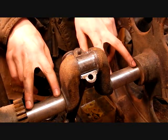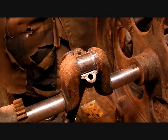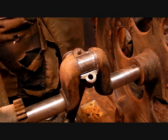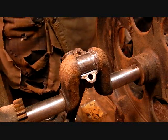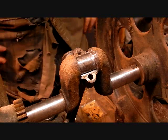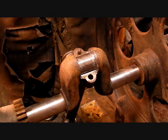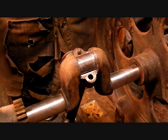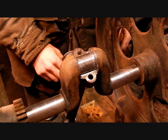While it's on the bench, I'm shimming the connecting rod bearing. I'll have to shim the main bearings once it's in the engine, but I figured this would be a good opportunity to show you how I shim babbitt bearings. Feel free to leave a comment if you disagree with something, because I'm just kind of figuring this out as I go along — but it's worked for me. I've done this on one other engine and also shimmed the main on this one before.